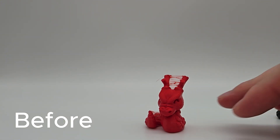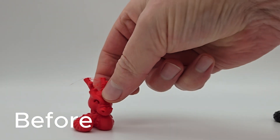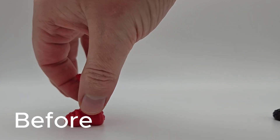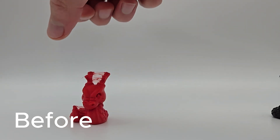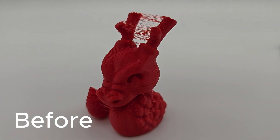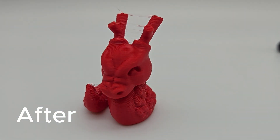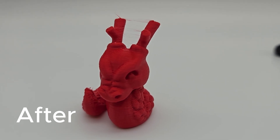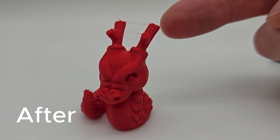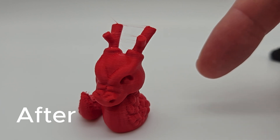The results are in. I have not only the PLA that I printed, but also a PETG — we'll get back to that later. This is how the PLA came out: you can see it's quite stringy. It's been open for about a year, definitely wet. Now let's look at what it looks like after four hours in the dryer. The print looks almost new again — super old filament, but this is a stress test. You're going to get this result with just about any brand new filament; it's going to look like this or better.